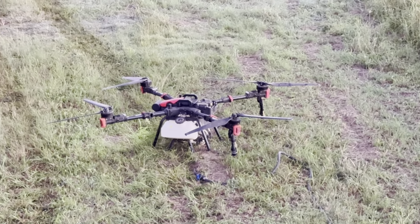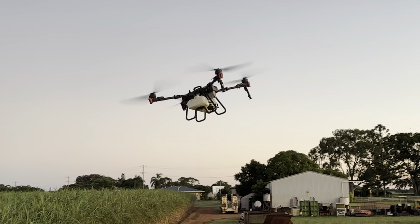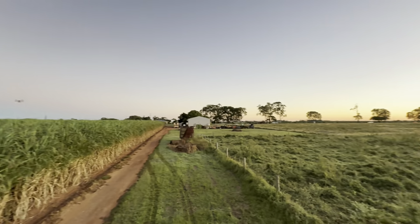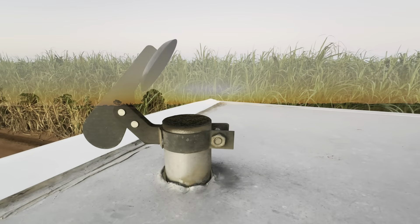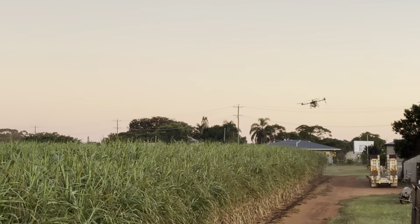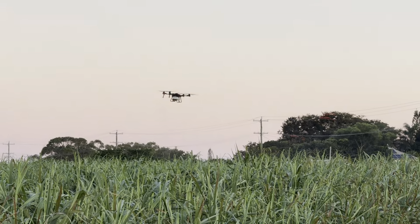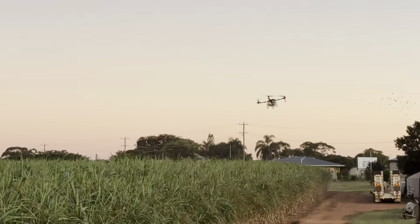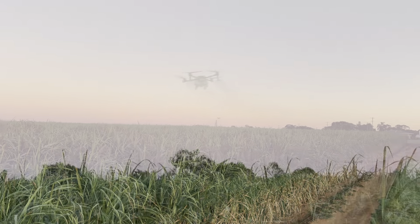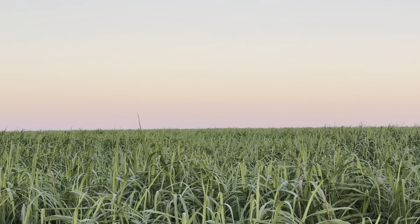You can see here Luke's manhandling the drone. There's a sensor inside and sometimes it plays up a bit, so it needs a bit of a rattle to get it to read the correct level. We're operating off five batteries in total. The drone itself only takes two batteries at a time — you can't put three or five in, it only takes two or one. With two batteries you can operate a full tank; with one battery you can only operate half a tank, which is 20 litres — just a bit below half. Full tank is 55 litres; half a tank is technically 26–27 litres, but to take off with one battery the limit is 20 litres.